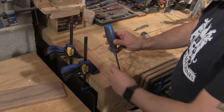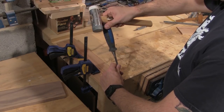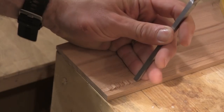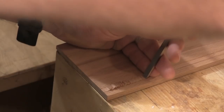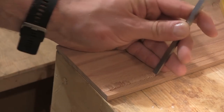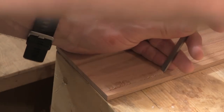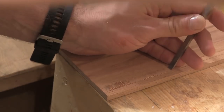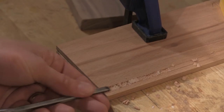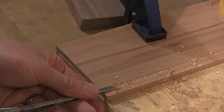I then use my chisel to start removing the waste material. I start at one end and begin chiseling. I place the chisel at a slight angle with the bevel facing the surface of the board. By placing my fingers towards the cutting edge I can guide the chisel, making it easier to place but also to control the depth. I tap fairly lightly on the chisel with my mallet and work steadily along the length of the marks, occasionally stopping to brush out some of the waste material. I then work in from the end to remove more material and to flatten the bottom, using a gentle yet controlled and deliberate action on the chisel.